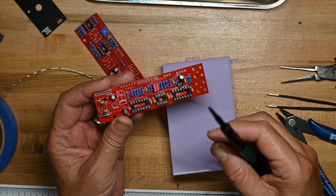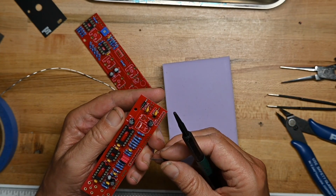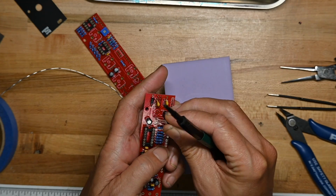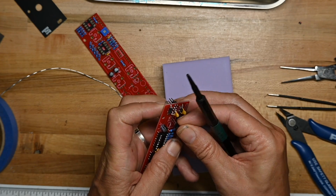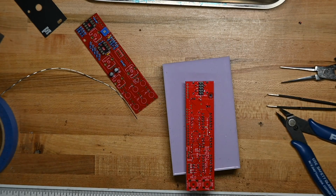But next is the voltage regulator. They did display it. Sometimes they lay them inline, sometimes they display them as a tripod. This is a tripod one, which I guess some people think is easier to solder without bridging, but I don't. Once you get the hang of it, the inline ones are just as easy to not bridge as, or I should say, equally as difficult to not bridge as the tripod shaped ones.